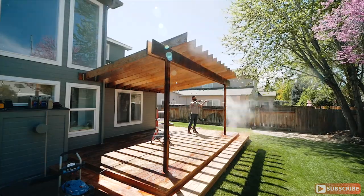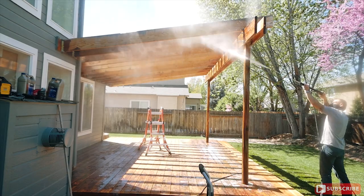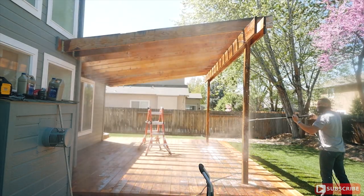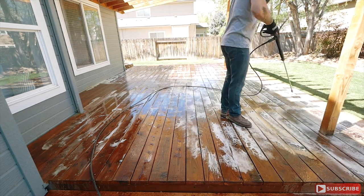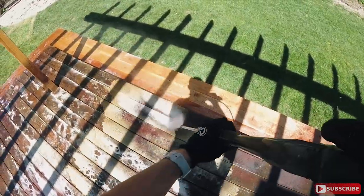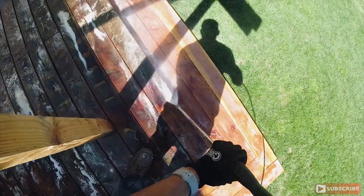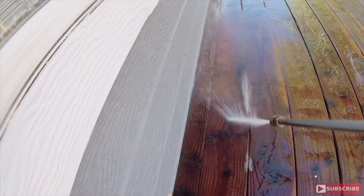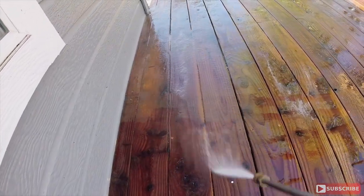When pressure washing to rinse off the chemicals, really try to avoid running the spray nozzle side to side across the boards. Instead, run it with the grain along the boards — this will prevent any tear-outs or damage to the wood. The best safety advice: learn from my mistakes. Put on long-sleeve clothing along with a hat. This chemical basically acts like Nair hair remover — almost like an acid. Definitely wear goggles, a respirator, a hat, and long sleeves to save yourself from burn marks later.